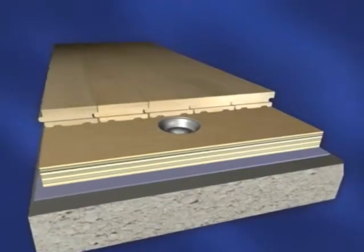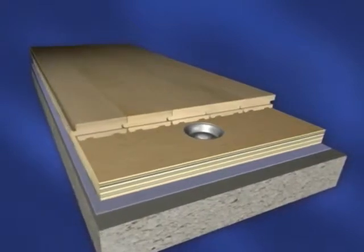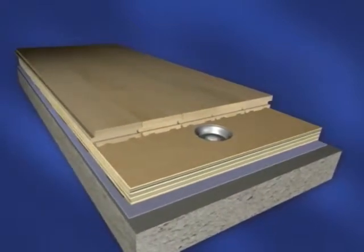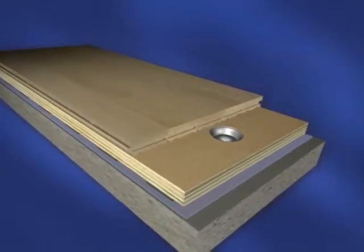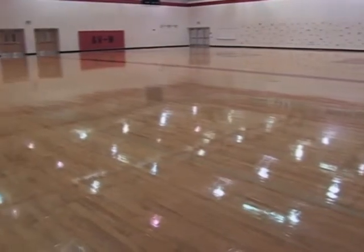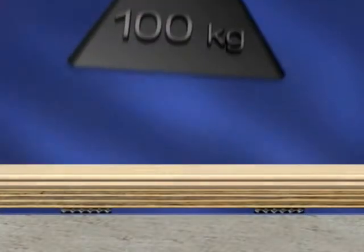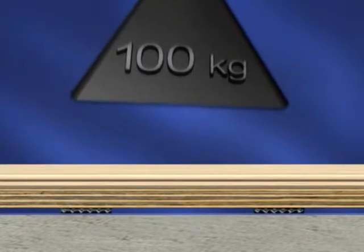Action Floor Systems AnchorTech Low Profile Floor System is the next generation anchored resilient design. This innovative new floor system design utilizes plywood panels with natural rubber pads and anchoring thrust pins to maximize dimensional stability and strength. This combination creates a floor system that is highly resilient yet delivers a fast rate of play with good ball bounce while maintaining excellent shock absorption.